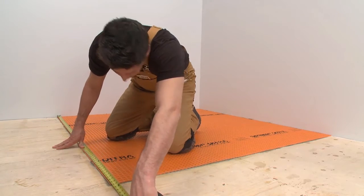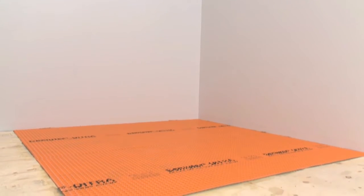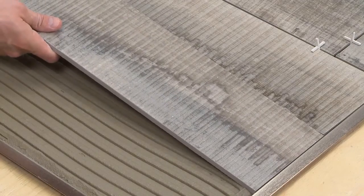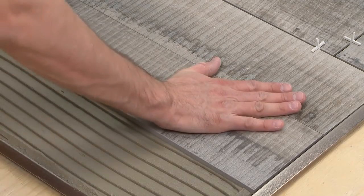With the planning complete, let's prepare for installation. The floor is now ready for tile installation. We have installed the Schluter DITRA uncoupling membrane where the tile is going to be set. The Reno TK profiles are installed at the same time as the tile. This sequence may vary — it depends on your layout and installer preference.